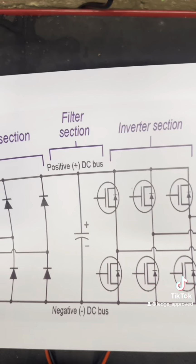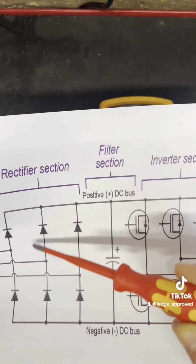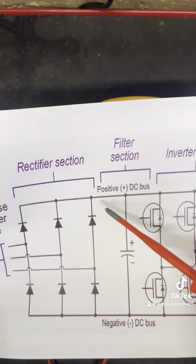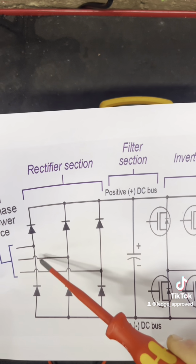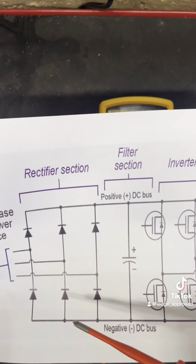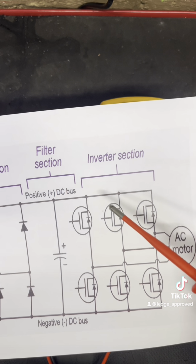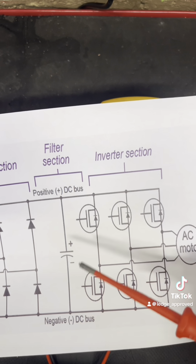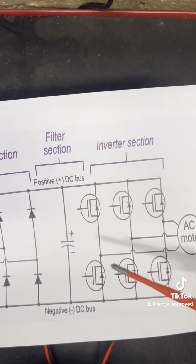So what we're going to do now is a diode check. With this diode check, we're checking the volt drop over our diodes and our IGBTs to ensure that we're getting correct flow. This is ensuring we're getting correct flow of power across our circuit. Because remembering, with the DC side it should only be going one way, and with our IGBTs it should only flow one way as well. So they've got diodes in their circuits.